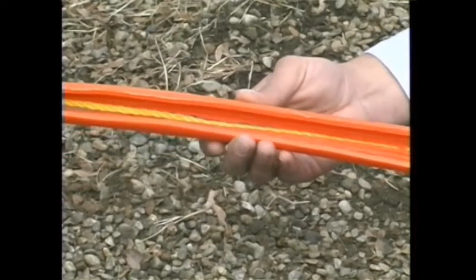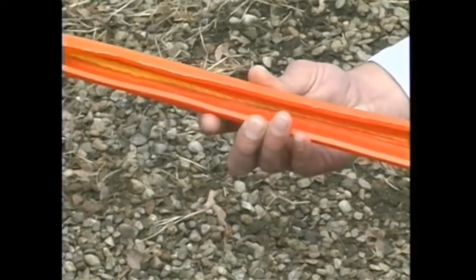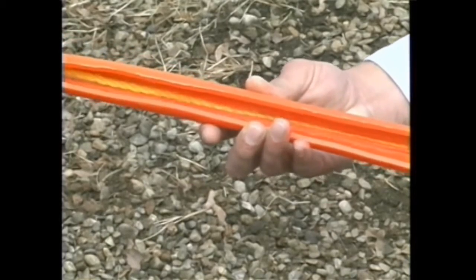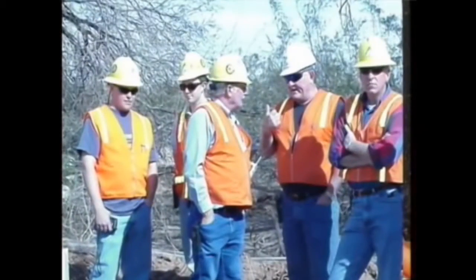The simple repetitive motion of rope rubbing against plastic duct can melt a groove clean through inner duct after only minutes into a pull. And that groove is precisely where your fiber optic cable is likely to get stuck or damaged during the pull. That can mean serious downtime and labor costs that no one budgeted for.